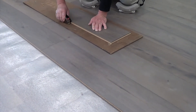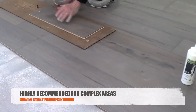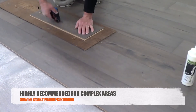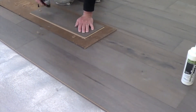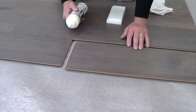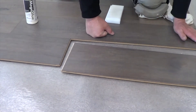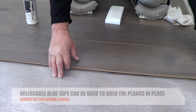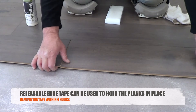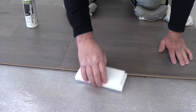If you're fitting around a tight area — under a toe kick or around a door jamb — you can remove the groove side bump on both the long side and the short side. With the groove side modified on both ends, apply a bead of Mega Glue down both sides, turning this into a flat, glued installation. This is an approved method by Mannington using the Mannington Mega Glue.